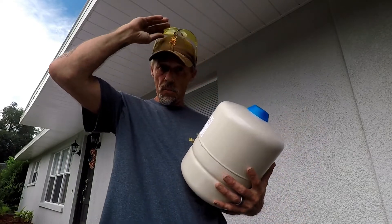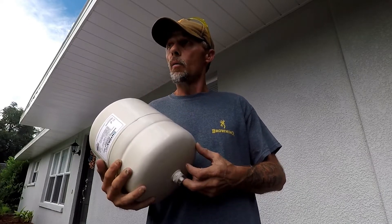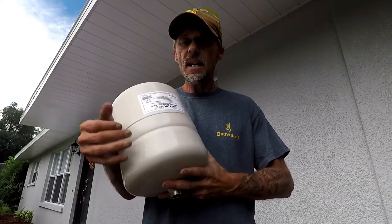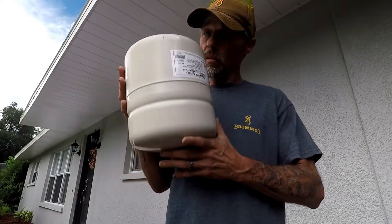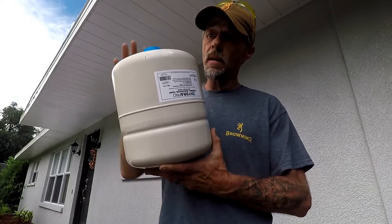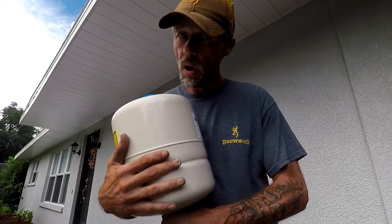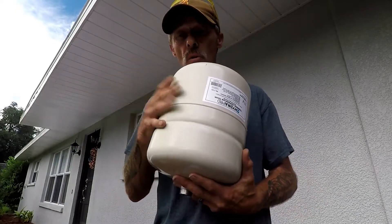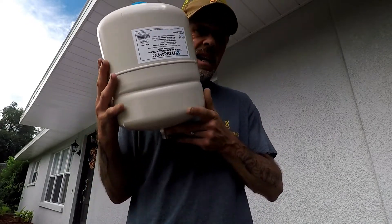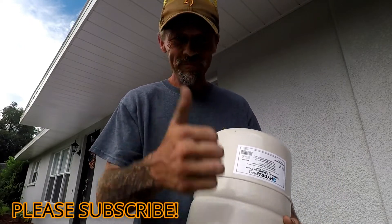That's all the time we got for today. I appreciate you all hanging out and watching me talk about some plumbing, but this is very important. I was reminded by a couple of you smart viewers that I forgot to show one of the most critical steps to install these things. Remember, these tanks generally come pre-charged at about 40 PSI from the factory. Residential average water pressure from the city or a well is going to be between 50 and 60 pounds, so right out of the gate, be prepared to add some air. If you do not match the air pressure and the city pressure together, it's not going to be effective. Thanks to everybody in the community. This has been Plumbing with Tim — keep plumbing.